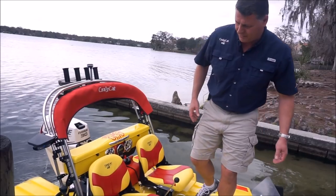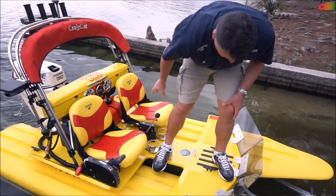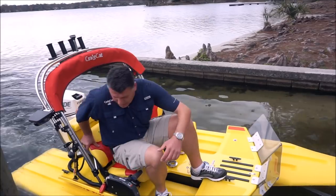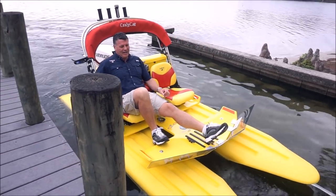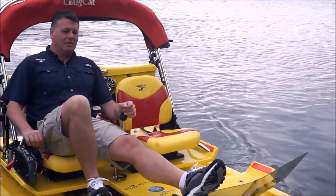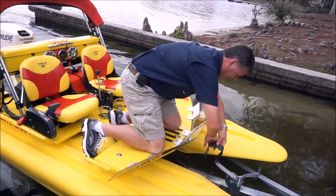That's one of the beautiful things about these new engines. I'm going to put it in forward gear and bring the boat a little bit further forward on the trailer. Now I'm going to drop the winch strap and the safety chain off. That's it — the boat's free. So what we can do is just drop it into reverse gear and the boat's going to slide right off the trailer. Now, of course, when you're bringing it in, we're just going to do the opposite — bring it right back up on the trailer, leave it in forward gear, and the boat will stay right there.